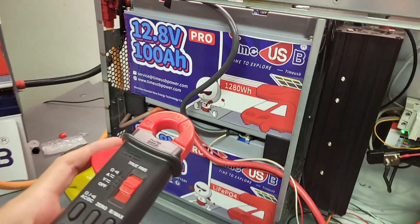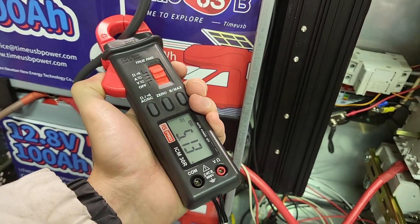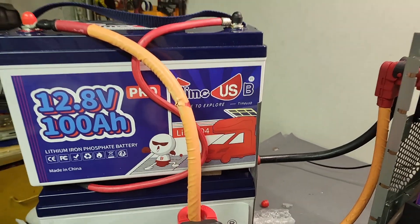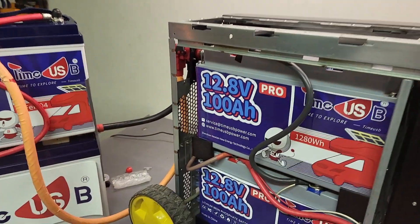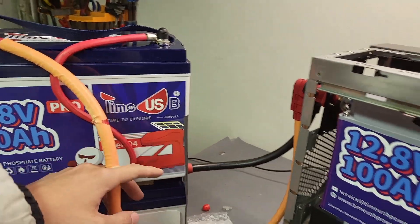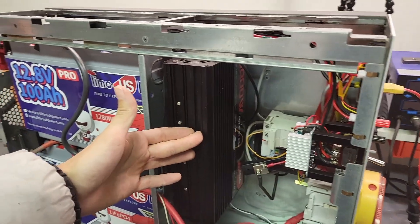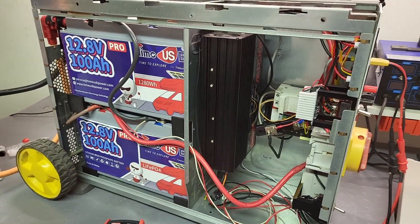Even with a relatively low current, any potential imbalance between the two battery packs should become evident. I'm drawing 11 amps from the batteries and the meter shows 10.9 — perfect. Now I check how much current is coming from each battery pack using the clamp meter: I measure 5.13 amps on one side and 5.70 amps on the other. Strangely, the external battery pack, even with slightly longer cables, is supplying slightly more current — I expected increased resistance to give lower current. Unfortunately I can't run a full power test since the inverter is stuck at 120 volts.